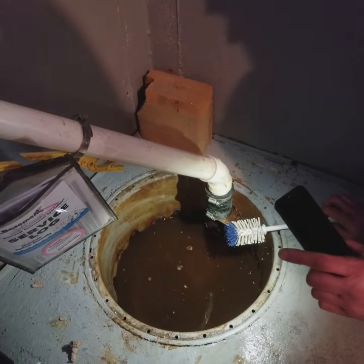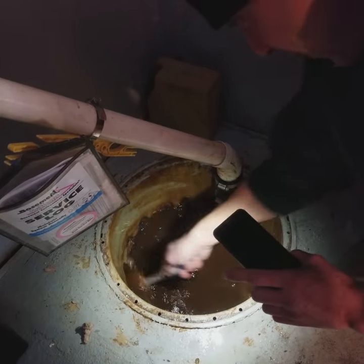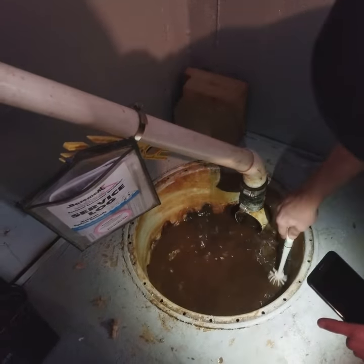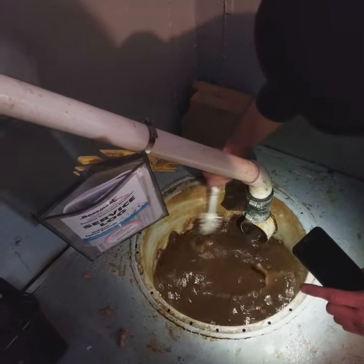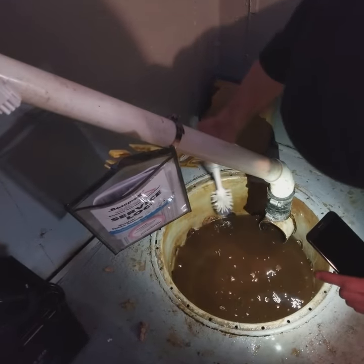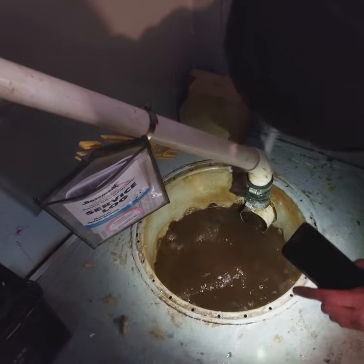It's turning black. So what's that mean? It's killing it. Now when we were looking in there at one point, we thought we saw little holes on the side of the tank. Yep, that allows the water to come in the liner. Okay. So you can pump it up. So if those get blocked with that crap. Yep. Which is, again, called iron ochre. It comes from algae, wetlands. Gotcha.